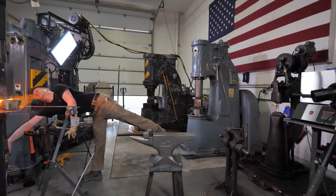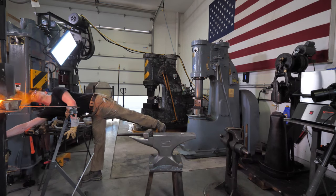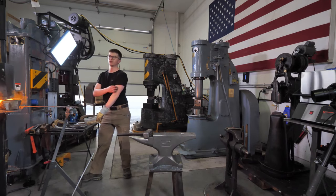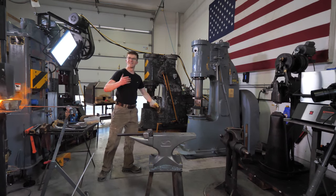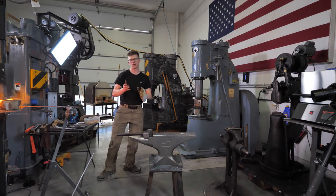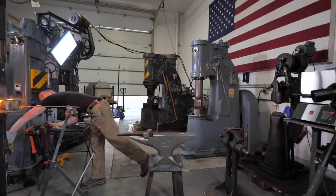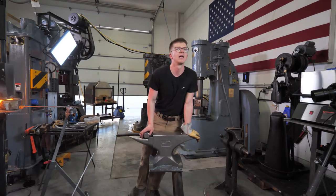There is a kind of excuse that I think is reasonable, and that is this. When we're working on making the one-heat tong blank from the other side, let me adjust the forge down a little bit, this time I'm closing the air. All of the residual heat that's in the bar conducts through and keeps it hot for longer. But now we don't have as much residual heat because it tapers off right back there. So that's what's happening.